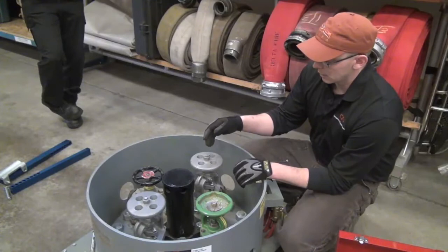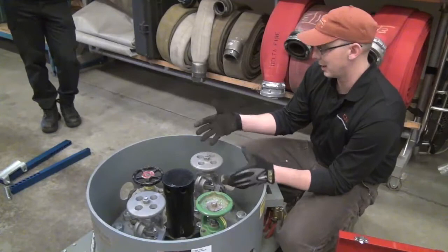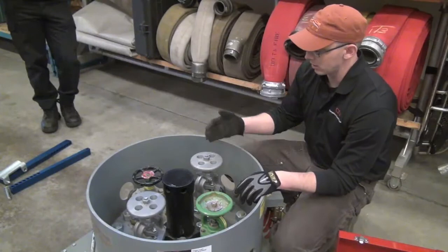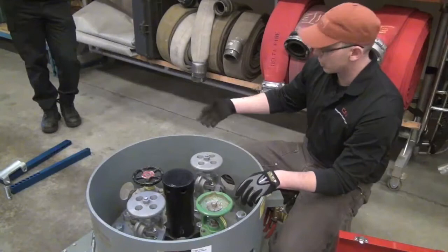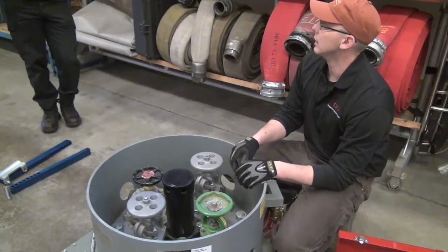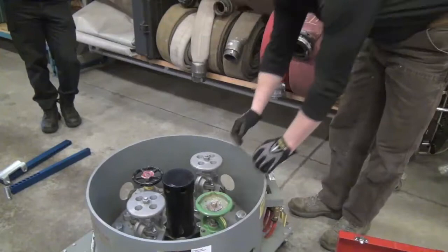A couple other things you should suspect. If you have a monster leak coming out of the car - it's going to have to be pretty cold to actually see free liquid, because as soon as it gets out past the plug it'll boil off and give you a big vapor cloud. If you really have a pretty monster vapor cloud, you can narrow down right away that you're probably going to a liquid line because of the big expansion ratio. Something off of the vapor valve - unless the thing is absolutely wide open - is probably going to be a wispier kind of leak.